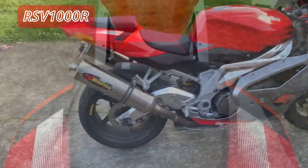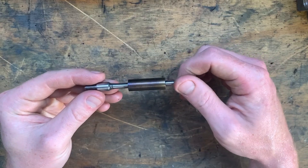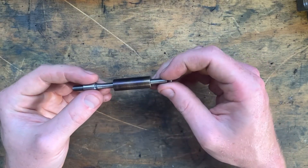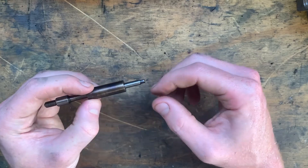What a great impulse buy — this thing just seemed to follow me home. Check out this engineering masterpiece. It's the standard oil pump drive shaft, threaded on one end for a sprocket with a tang on the other, and what I've done is shrink fit each end into a small bush I made up on the lathe.